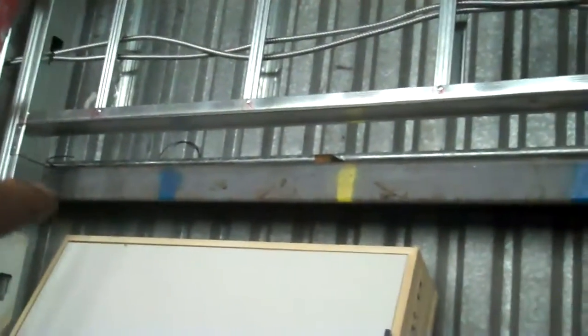Standing here at the new storefront location, we've got to cut it in. We're framed in for it, but we've got this beam across here that's going to have to be raised up. So it's going to have to be reframed to re-secure this siding. I've got nothing to attach the door to for the new aluminum storefront, and then the drywall can return into the new storefront. So it's a double door setup with glass on each side — they're going to come tinted.